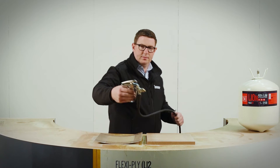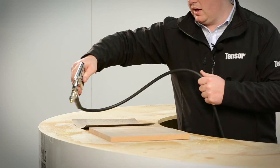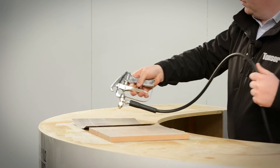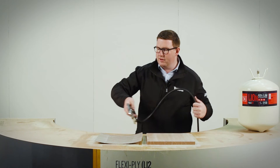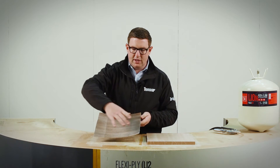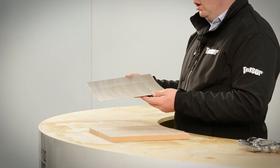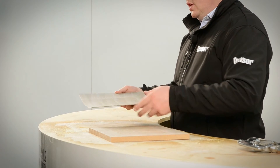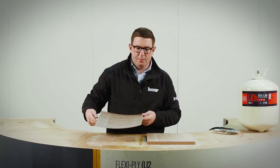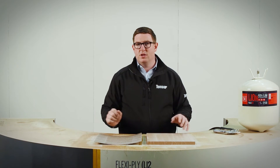So we're ready to go. 75% overlap — I'm doing about a four-inch pattern here, so nothing too big because it's a small article. Then I'm going to go the opposite way on the other side, moving the gun swiftly but with a 75% overlap. What that actually does is it delivers a flatter finish on the spray pattern, rather than ending up with very high ridges. By overlapping the spray pattern by 75% and moving the gun slightly faster, you will get a better result across the surfaces.